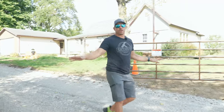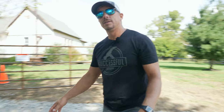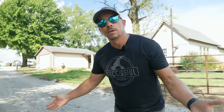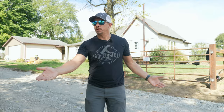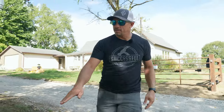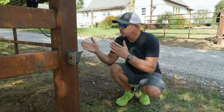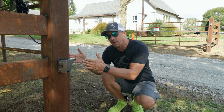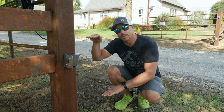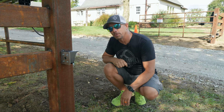Don't catch me walking through the gate because this isn't for pedestrians. But watch — you can see how that gate stopped when I walked through. I did something super dangerous, and somehow the gate knew I was here because of these safety devices. Speaking of these safety devices, there's a requirement for where they need to be mounted: they have to be mounted within five inches of the gate panel, and between 21 and 27.5 inches off the ground. If you're installing these, that's the requirement.